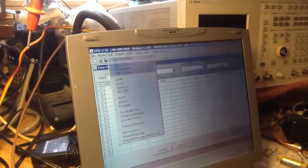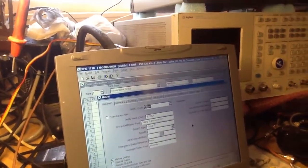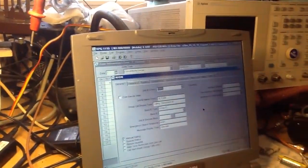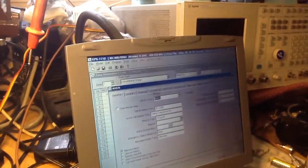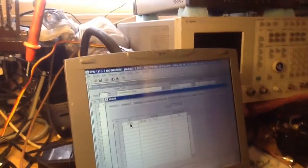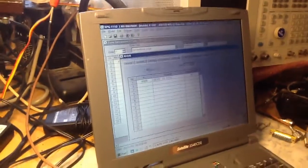Select Edit, then scroll down to NXDN. When that pops up, go over to NX group ID. Come up here, go into the ID list, select group ID list, then make your single group and put in the ID number of 65,000. It's going to say group ID and default to 001 — that's how you actually make your group ID, or your talk group.